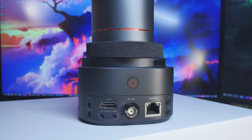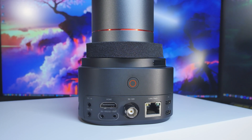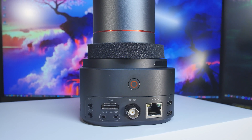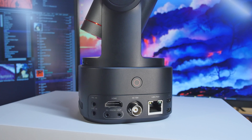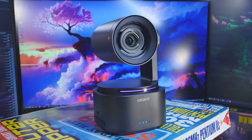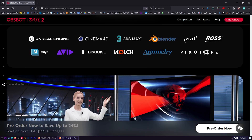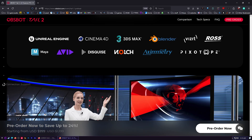Another really cool thing about that ethernet port is it can also deliver PoE — meaning power over ethernet. You just plug it in, you get an IP that becomes your video signal you can run wherever, and then you're also powered and ready to go. A single ethernet cable is all you need. Then you have your 3G SDI connection — again just video, not for audio. We also have the SD card slot, which is what we're using to record in the field; just make sure you get something fast enough to keep up with 4K and some high bit rates. There's also connection support for Unreal Engine, Blender, 3D Studio Max, Maya, Cinema 4D — lots of stuff you can use this with. Pelco D and Pelco P as well, so if you've got a controller that works with those, you can use that to control all these.